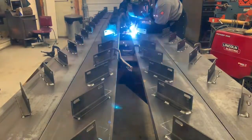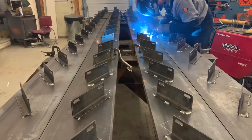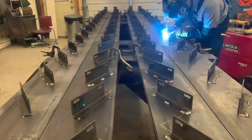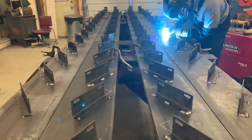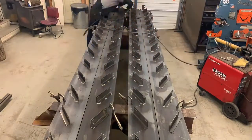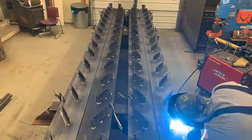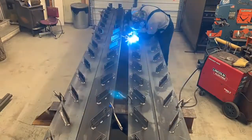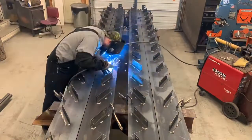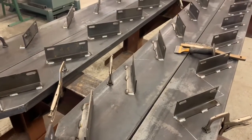I'll work back and forth, and this process takes a couple of hours. You don't want to put that much heat all in one place — if you were to weld from the bottom all the way to the top, all 18 clips without stopping or jumping around, they'll bow. They bow even a little bit doing it this way. I've got them all clamped down to four sawhorses, so be careful how much heat you put into this stuff — they will distort. And that's pretty much a wrap on these stringers.